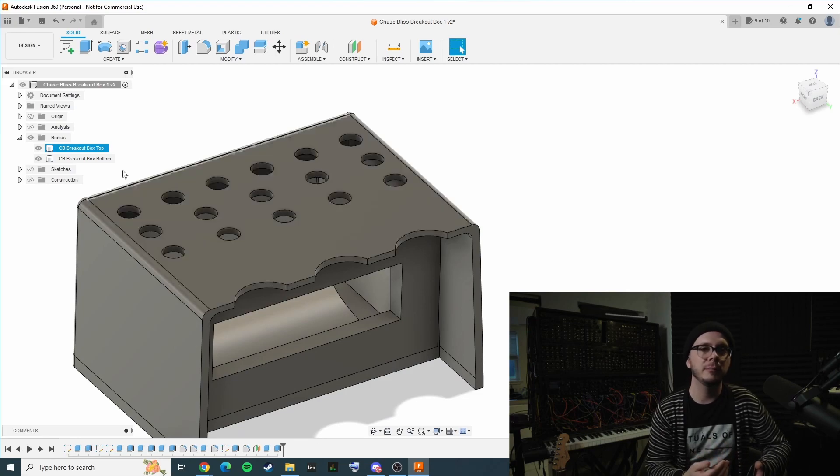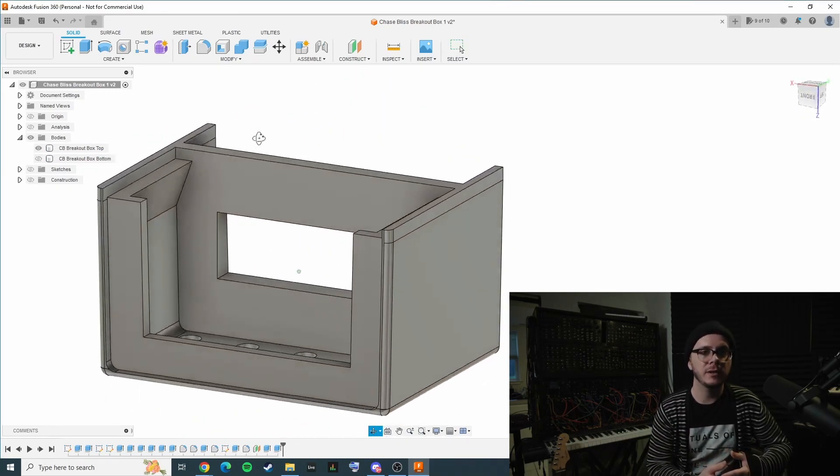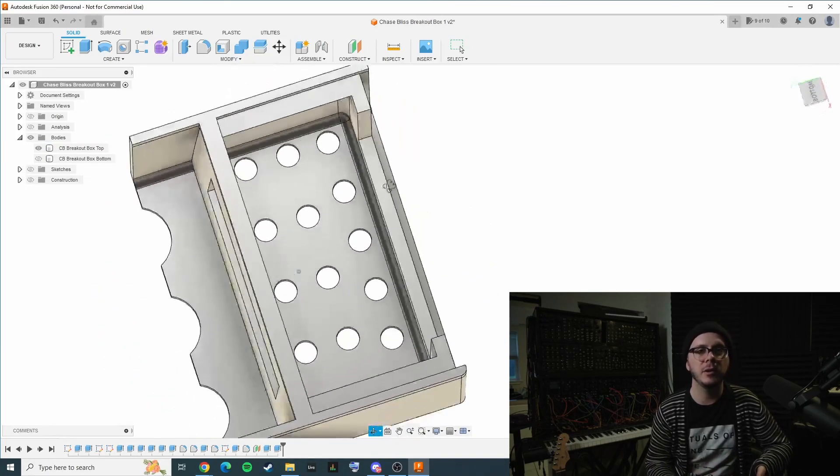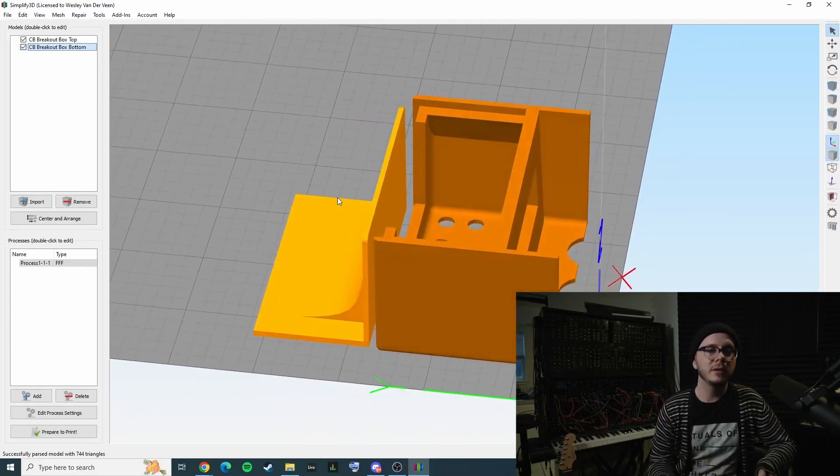After sketching out the front panel on paper, I popped into Fusion 360 to bang out a design for a 3D printed box that'll stick onto the top of the pedal with dual lock and serve as a home for all those switches. The lid opens up in the back as well as the bottom, because trying to do laparoscopic surgery on this thing through just the bottom would be impossible even if you have small hands. I'll post the STL file on Thingiverse and put a link in the description. This is going to be a very easy print — no supports, just a bit of easy bridging. Any color, material, and nozzle size will work; just make sure it doesn't warp too much or it won't fit squarely on the pedal. I chose black PETG and an 0.8mm nozzle — it's what was already on my printer, and there's not that much detail in this model anyway. Before moving on, make sure the switches can slide into the holes without forcing them, and hog those holes out a little wider with your drill if necessary.